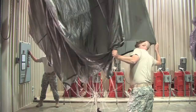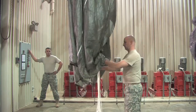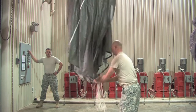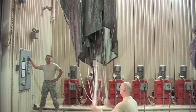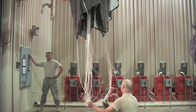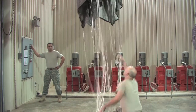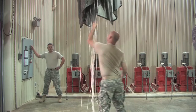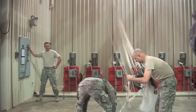Once the panel shaking process is completed, slowly raise the crane. As the crane is being raised, clear the suspension lines of debris and remove all entanglements. If necessary, you may call on another person for assistance during this procedure.